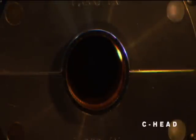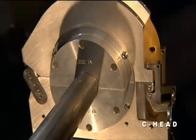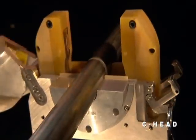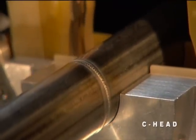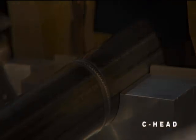Four models of the C-Head series cover tube size ranges of 0.125 inches to 4.5 inches, or 3 to 114 millimeters OD, all welding with machine tool precision and repeatability. Interchangeable collets allow each head to be used on a range of tube and fitting sizes. Digital technology forever eliminates the need for periodic head calibration. Head speed always remains accurate for consistently perfect welds.